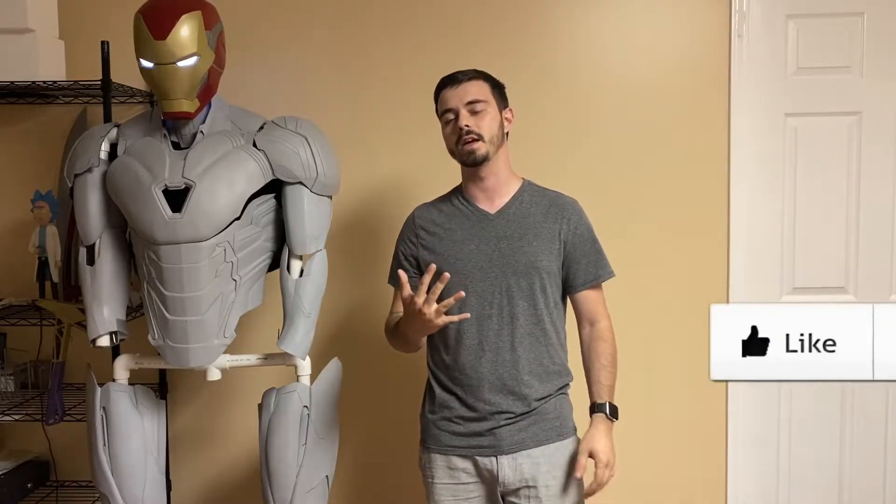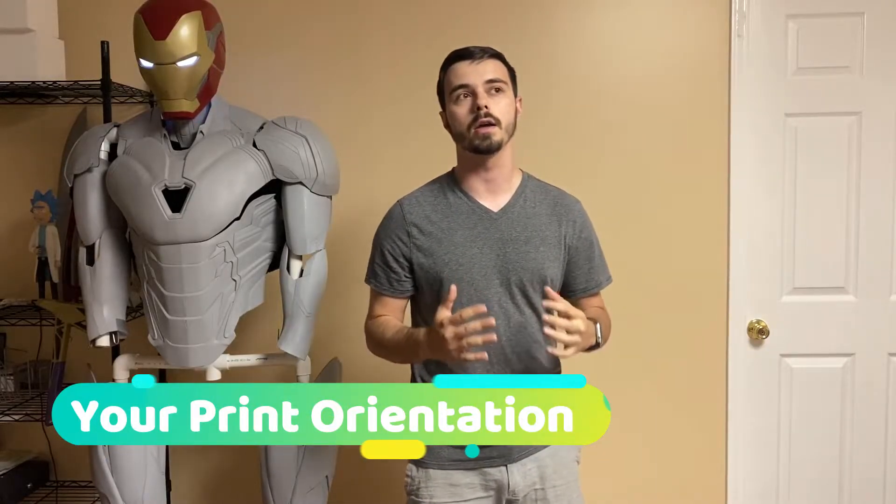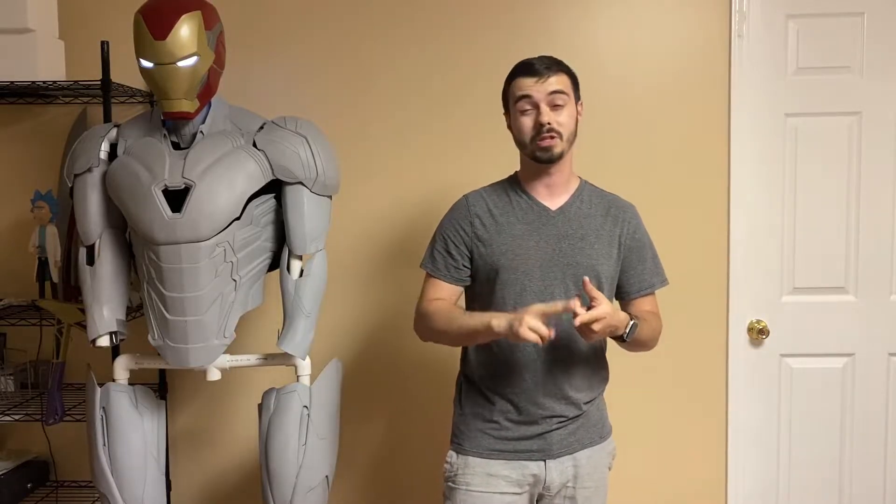What are the top 5 mistakes that I have made in 3D printing that you'll probably make that you can address and keep an eye out for? Number 5: print orientation. That one is not the most obvious one you would think of, but it is a very important one. It does three things: your print quality will turn out differently, your print material usage, and your printing time.